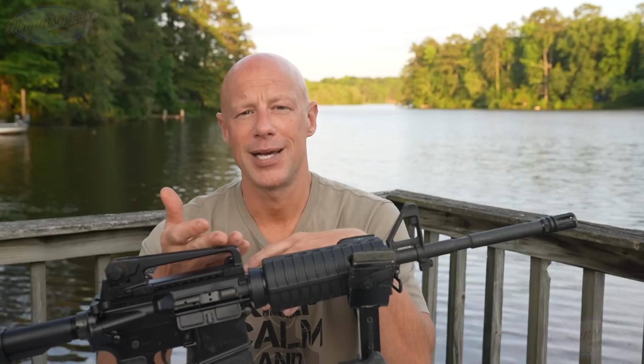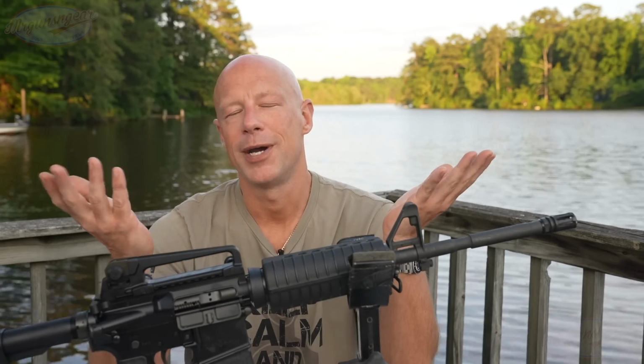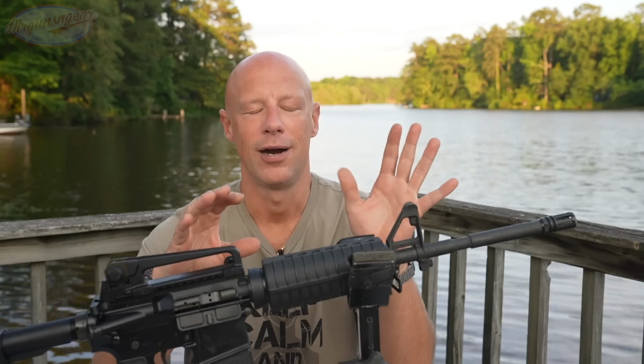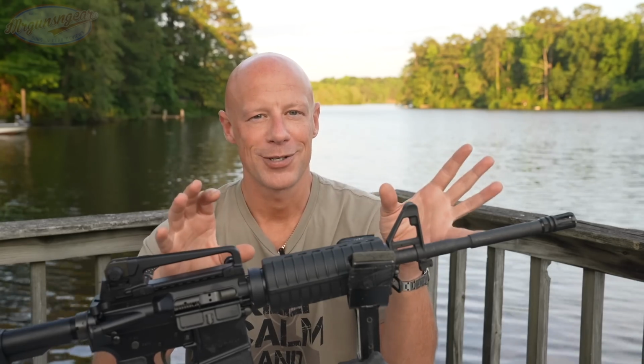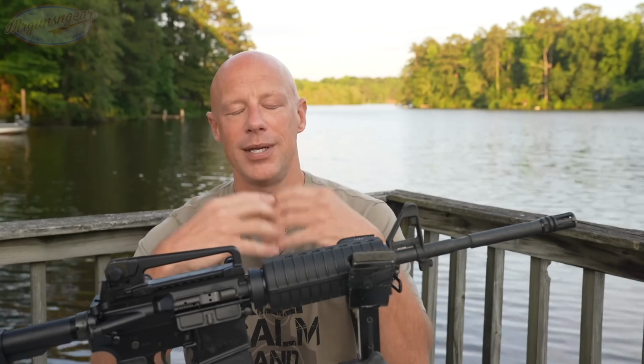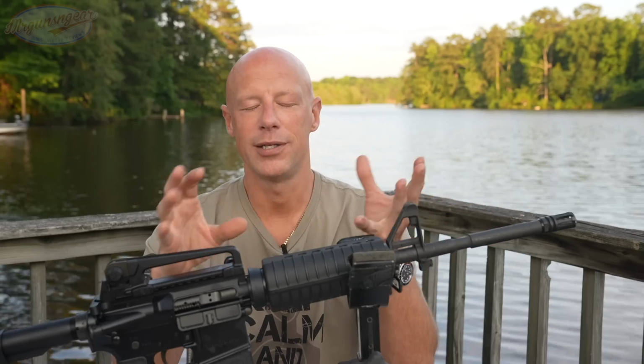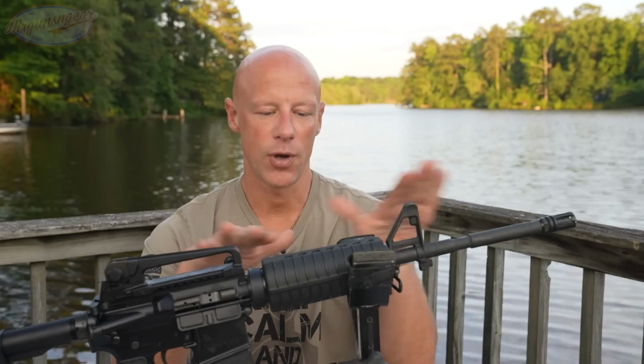If you're purchasing as the consumer, I would only expect to see an increase of somewhere between $5 to $25 added onto the gun to have one of the other treatments that we talked about. And like I just said, the barrel and the bolt carrier group that we're going to get to in a second are the heart and soul of your rifle. So adding the extra $5 to $25 over that finish, in my opinion, is simply 100% worth it. You're going to get better longevity with any of the different types that we just talked about, and you're going to get better surface hardness. You're going to get just better everything, corrosion resistance, all of those properties are going to be better than just a 4150 or 4140. Those are just different types of steels with a phosphate finish. I don't recommend those.